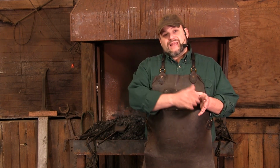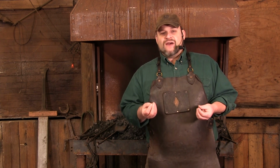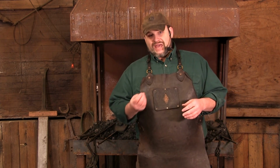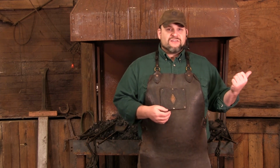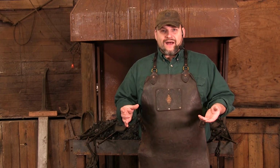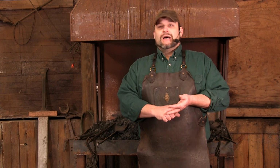So there were a ton of those made in the late 1800s, and then we had yet another advancement of technology, and that's when you see cast steel anvils. And the cast steel anvil is the pinnacle of anvil technology. In fact, all the really good anvils today are made from cast steel. Now, of course, there's always some junk that comes out of Mexico and China that's what they call ductile iron. That is just that. It's just a chunk of ductile iron that busts with a few hits. Now, there are some ductile iron farriers' anvils that have a steel plate out there, but at the end of the day, the cast steel anvils are still the best. That's like the Refflinghaus, Peddinghaus anvils, Nimba anvils, and a lot of the ones that are modern are made out of high-quality cast steel, and they're the top of the line.